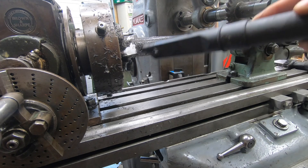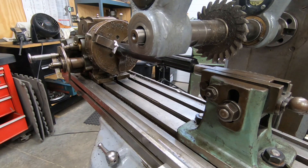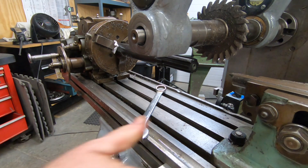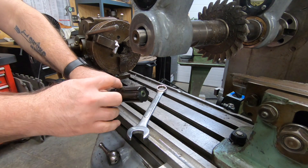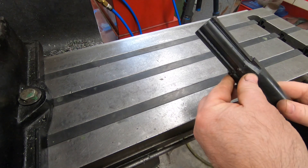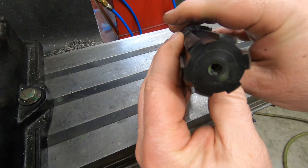That's it — I'll do a little cleanup here and get rid of some of these Delrin chips off the table, then take this shaft out and examine it. The question is: did I do this right? Did I have the math correct? Did I design and rotate this thing correctly? Taking a closer look at it, it certainly looks like a spline shaft. None of the splines appear to be different thickness than the others, so I must have rotated the indexing head the correct number each time.